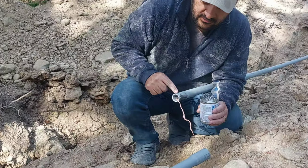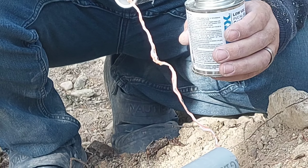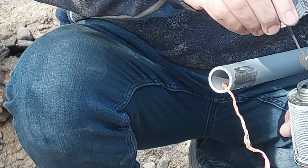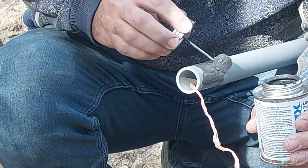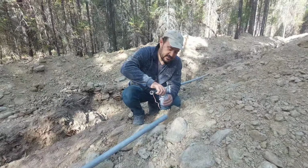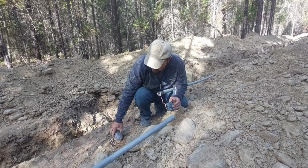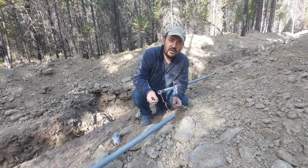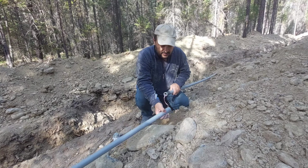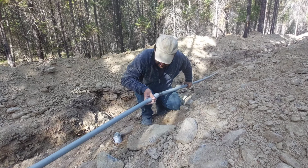And if you see it, I'm not going over because I don't want the glue to connect with the plastic rope that I use to pull the wires. Even if you connect them one next to the other, it will be hard to actually pull it back. You can try it and you're going to see it, and when it's buried in the ground it will not really move. So I think you can get away without using any glue. Just connect them together. That will be enough.